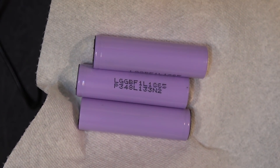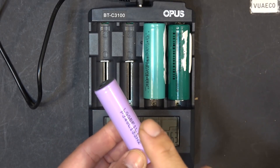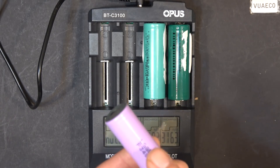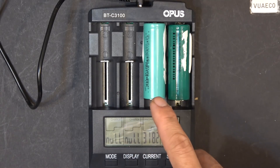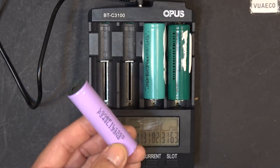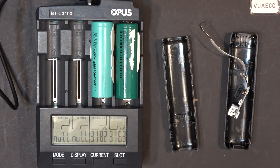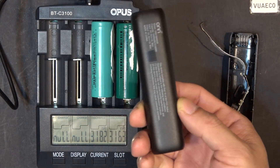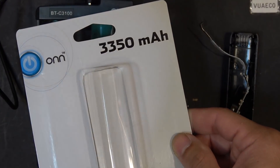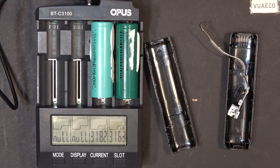In my previous test with LG 3350mAh cells, I also got close to this value — a little bit better, about 3,200-something, almost 3,300. So the LG cells are just a little bit better than these, but also a little more expensive. I haven't used these generic cells long enough to tell you how durable they are. The LG cells are fine, though I do have a fair share of those fail on me too. All in all, this is a successful test. You can find these cells in generic no-brand USB power banks like this Walmart one, and also in aftermarket laptop batteries. The durability remains to be seen, but they do offer good value for the money. And that's all for now — I'll see you next time.